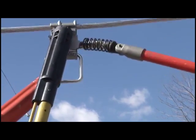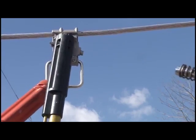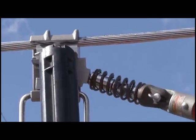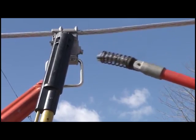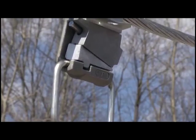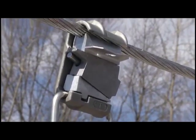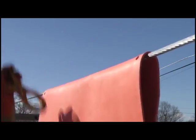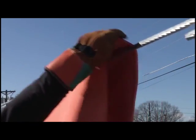The top head of the bolt will shear off at approximately 150 inch-pounds or 12 foot-pounds of torque, which results in 3,000 pounds of force in the connection. There is no need to tighten the secondary bolt head any further. With the bale in place, you may now connect a Connector Products HTC to the bale to complete the job at hand. Remove all coverings and safety gear and installation is now complete.